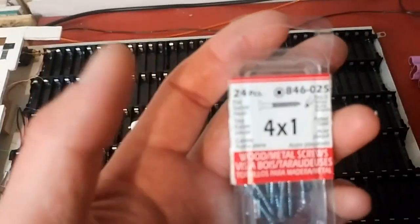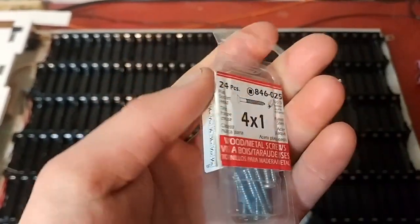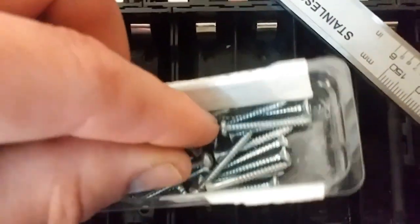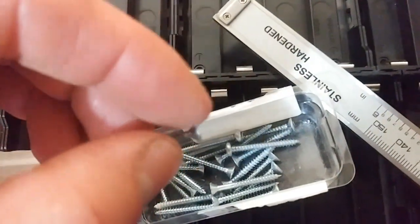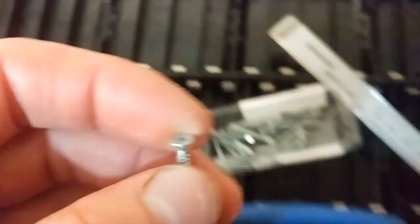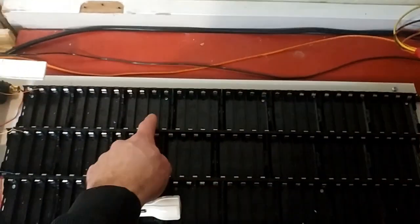And then you have to use these screws. They're a little pricey in my opinion, considering what they are, but you gotta buy these, and they have to be this kind. They cannot be, you see it down there? There's a mushroom head one. Do not use those. That one there too. Alright, they have to be this. They have to be a wedge shape. That's the most important thing for when you're screwing these down, because if it's a bumpy head, the battery can't sit down in there properly, because there'll be a bump. Instead, this is almost flush with the plastic. Pretty much boom, boom, boom, boom.